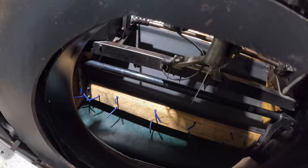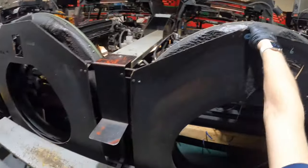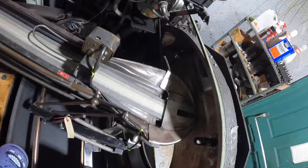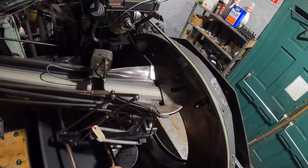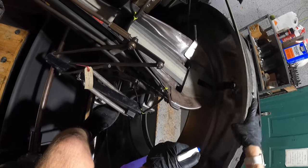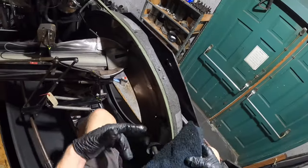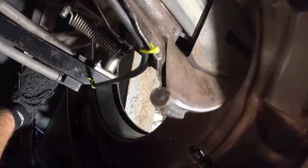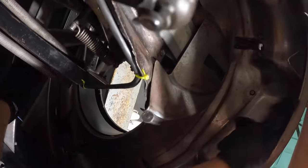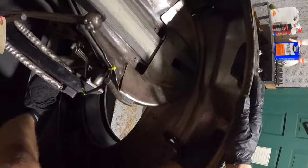Make sure you get the transition plate. Now I can get up here and I'm going to clean the pinwheel. What I do is I just rotate the wheel and just spray. Now that we got it all sprayed, take a clean side of the rag and go over everything. This helps to keep the pins clean. You've got to keep in mind that the pins are your main transportation of the dirt across the machine.